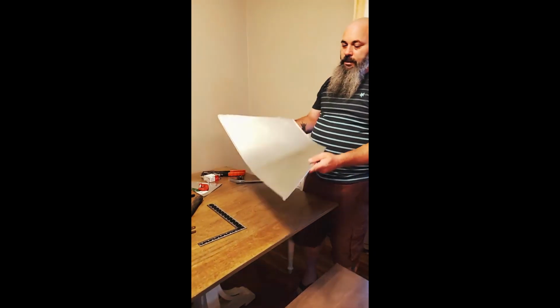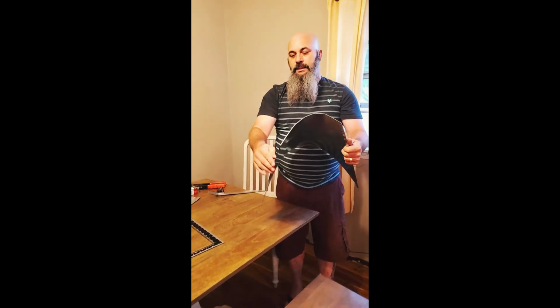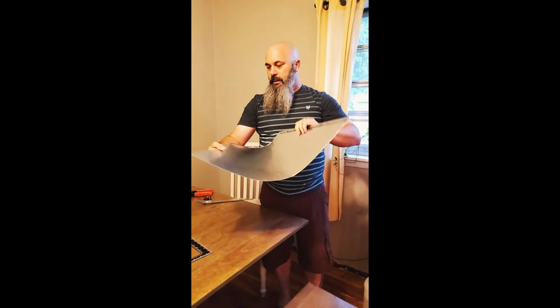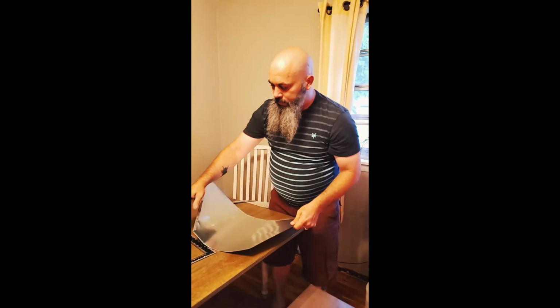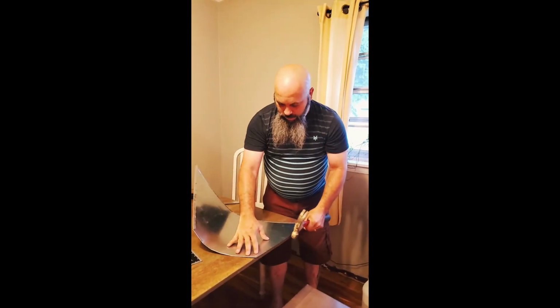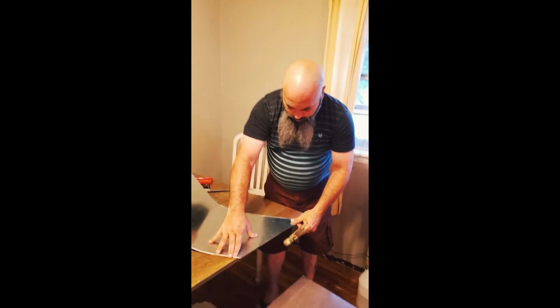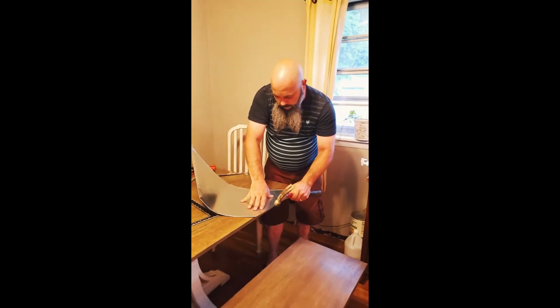So as you can see, when this cone comes in and it bends around, this edge has got to bend this way. So we go in and lock underneath it. So I've got that one already marked, and we'll do this side as well. Same process as we just did on that side there. Find my marks, roughen the edge, pull it down.